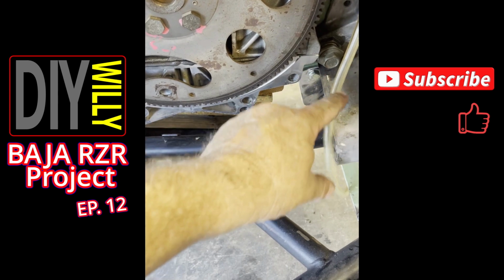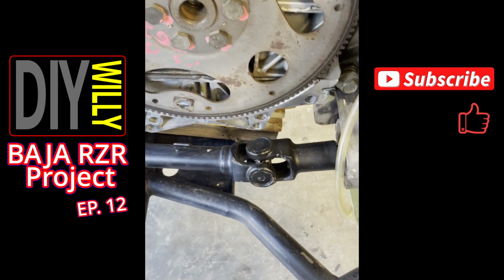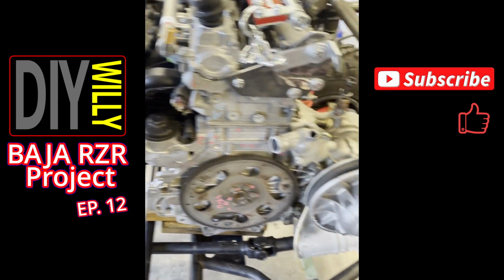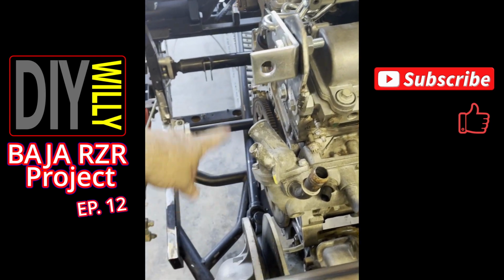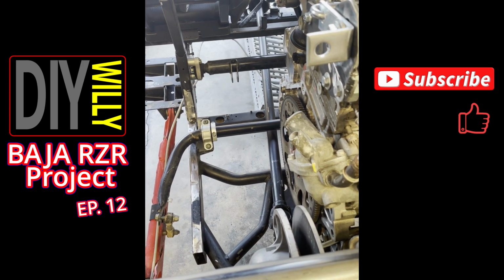I can take this down too. I don't have to have it this high. I can lower it. I got lots of room to lower it. So we'll see. We can see once we get the engine actually starting to find its place. If we can keep that 10 and a half dimension right here for the belt, oh man, that's going to save us a whole world of trouble.